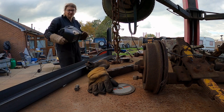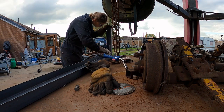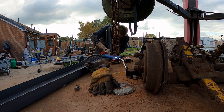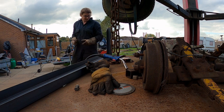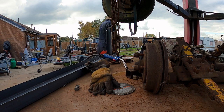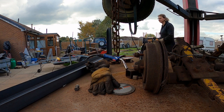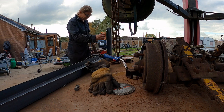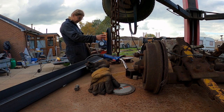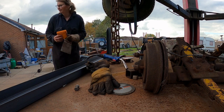Okay, so we didn't weld the mole grips on, so that was good. That's a good start always. So as long as the set square is square, then that's good. I'm going to trust the set square more than the angle gauge, only because with the angle gauge there is slightly more room for error. Not showing it as a mile out. Looks really good to the angle gauge, so I'm happy with that.